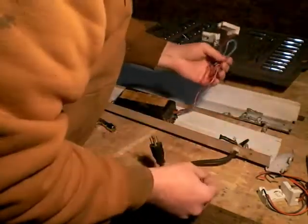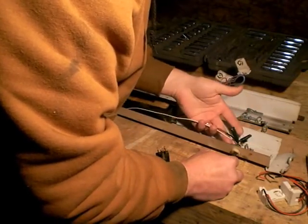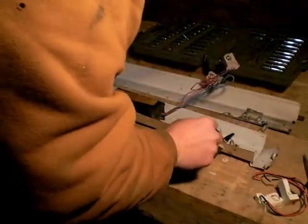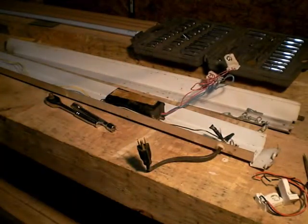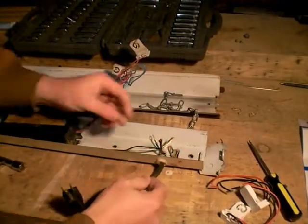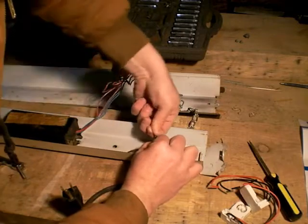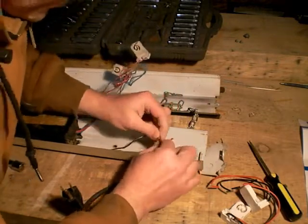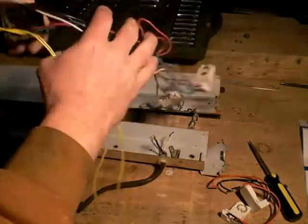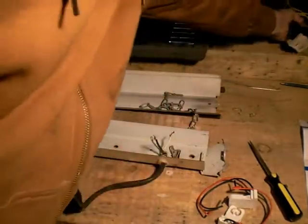We've already got these tombstones free. Somebody did an electrical tape job on this, so I'm going to undo this electrical tape and put a wire nut on when I attach these. I've got to get a clipper for snipping the wires. I've removed the electrical tape and now it's time to untwist these wires. That one's kind of pointy — that's a solid wire. I wasn't expecting a solid wire. Now we can remove the entire ballast and all its wiring. We're not going to need any of this, and it just adds weight anyway.